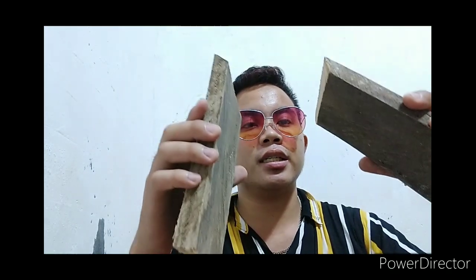First, I want to show you what the mitered butt joint is. A mitered butt joint is nearly the same as a basic butt joint, except that the two boards are joined at an angle instead of square to one another. The advantage is that the mitered butt joint will not show any end grain, and as such is quite aesthetically pleasing. However, the mitered butt joint isn't all that strong.